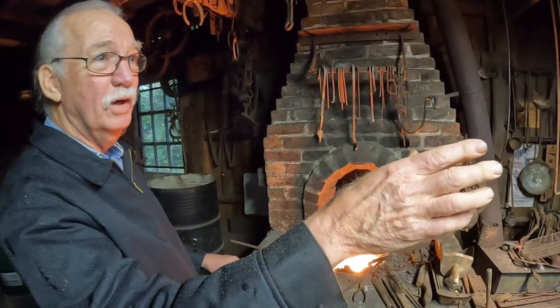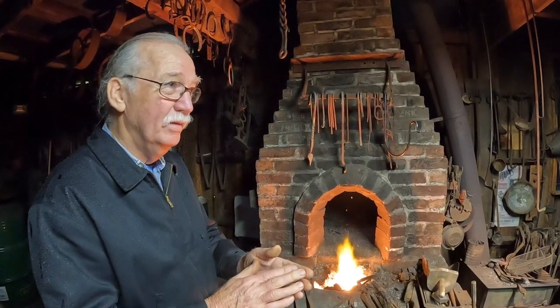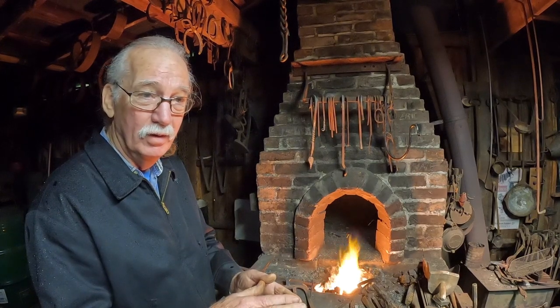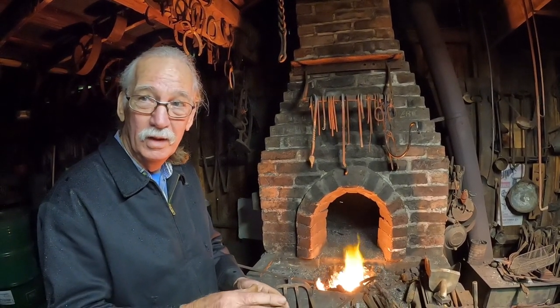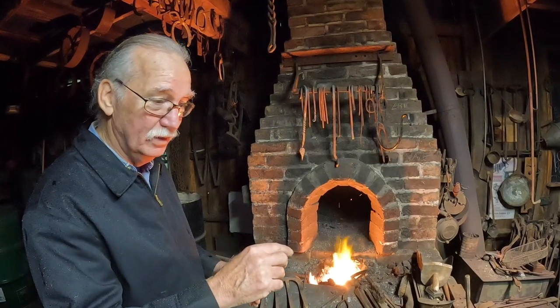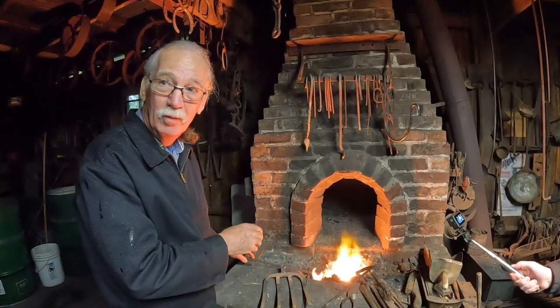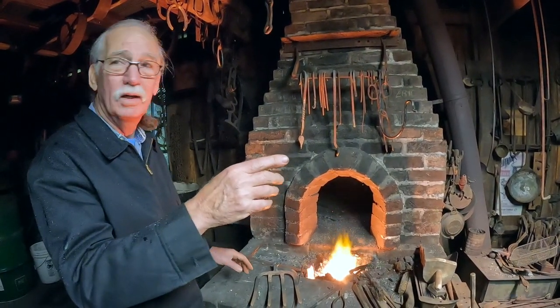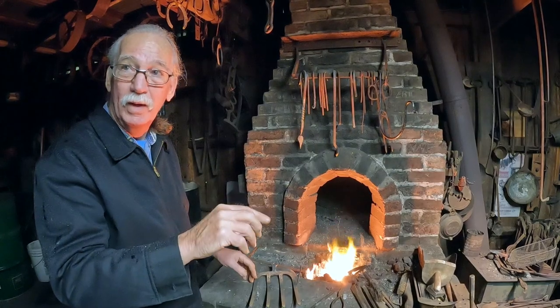The reason the windows are covered up is because color is critical when you're a blacksmith. Oh, really? Depending on what you're making, the edge of a straight razor has to be very hard steel, but it would be poor quality for an axe because of the brittleness. So that tempering process depends on the colors. The only way to gauge the temperature of the metal was by color. I used to have a chart, and it's probably up in the museum now, of colors to look for, depending on what tool you're making.